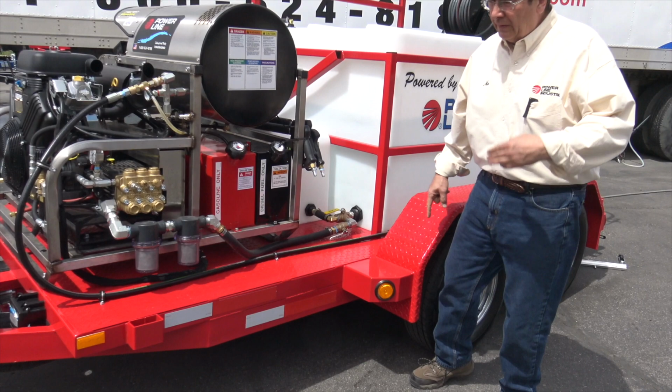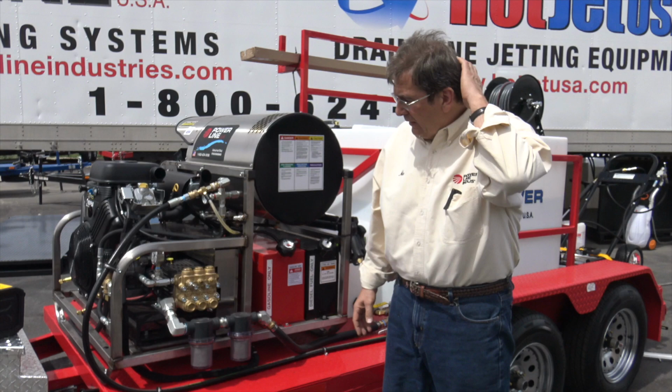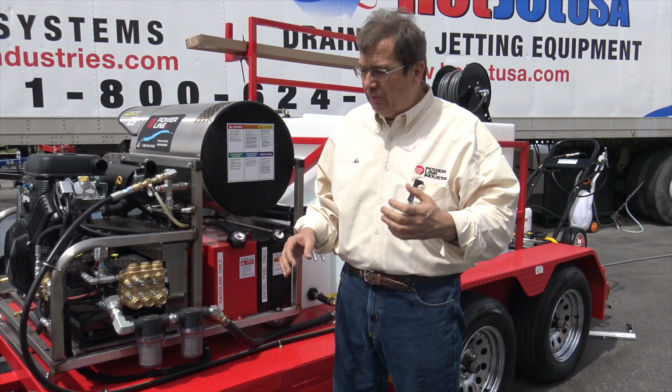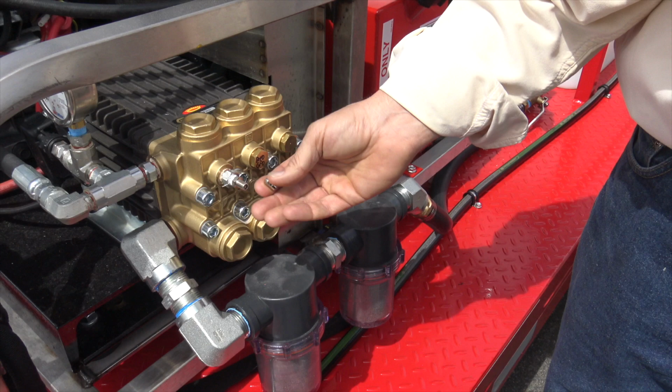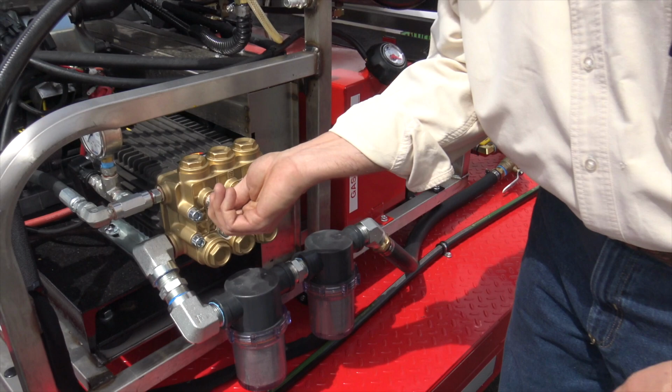Thirdly, if you ran it dry and shut it off, or if you ever run it dry, sometimes you gotta reprime the pump. Doesn't happen very often, but once in a blue moon, you have to run the equipment and take off this little primer valve, which you can also use as a blowout in the winter when we winterize, and you just turn it around, or you can use a screwdriver until the water comes out. That'll let the air out of the pump. You don't want to cavitate the pump too much. They're pretty tough pumps, best I've ever seen.